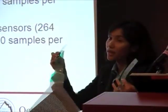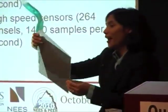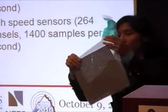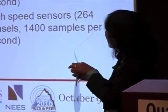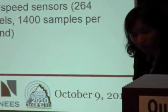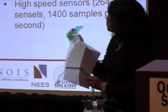If you attended Professor Tom O'Rourke's talk this morning, he put one around a 10-inch diameter pipe. That one is almost 2 feet by 2 feet — too big for me to bring over. It has about 2,000 sensing elements, and if you look closely you can see little lines connecting the circuit through those sensors. We have multiple sizes and different kinds of sensors, but we also have a high-speed version. This one has a sampling rate of 225 samples per second.